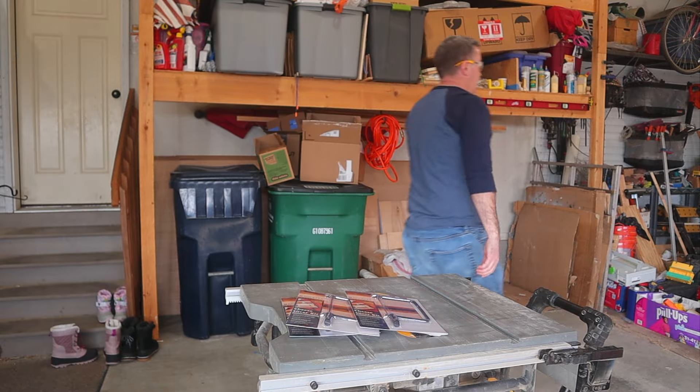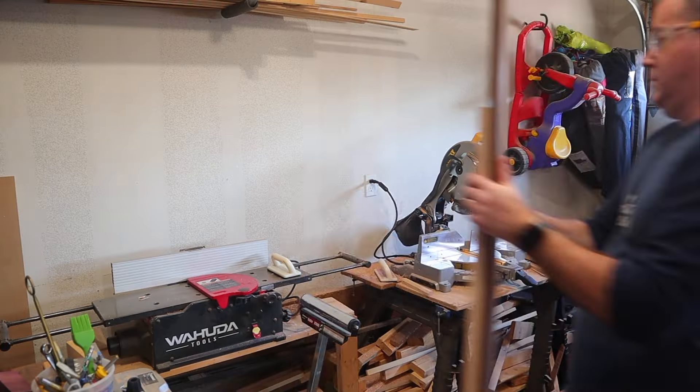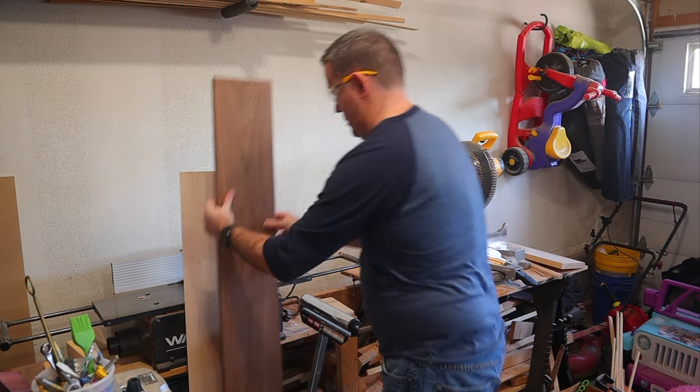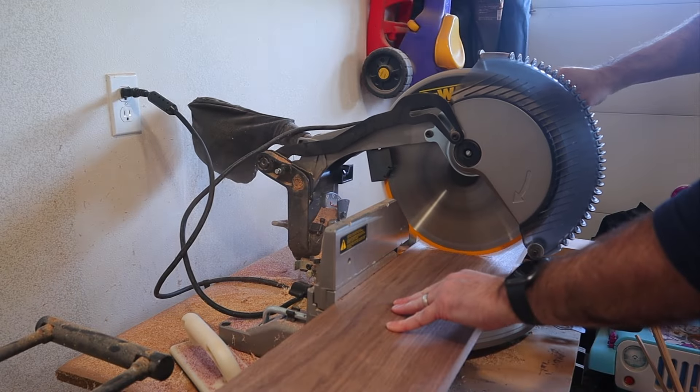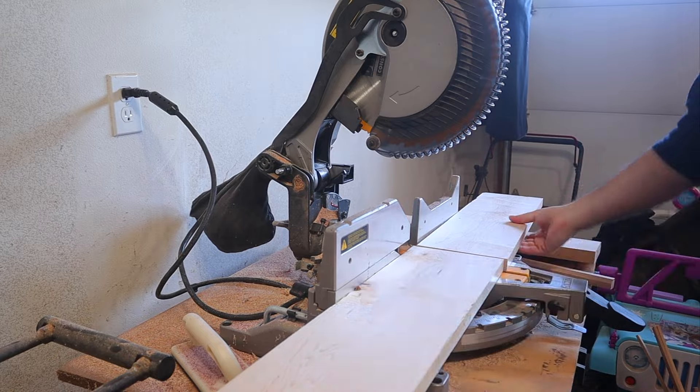I picked up a few of these cheese slicing kits to build into a few cutting boards, but the first thing I need to do is grab a little bit of walnut and maple to clean up to make these boards out of. Since I only have a small benchtop jointer, I cut the boards to more manageable lengths at the miter saw before firing it up.